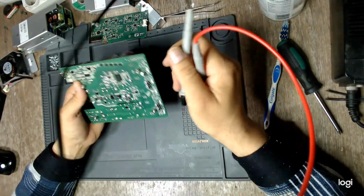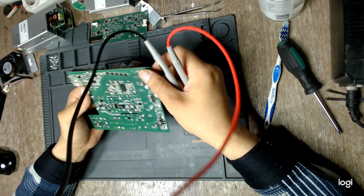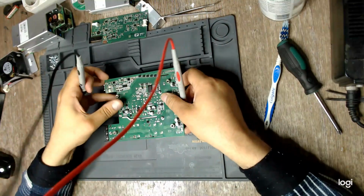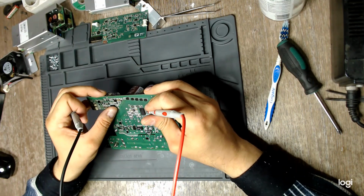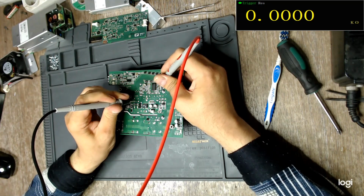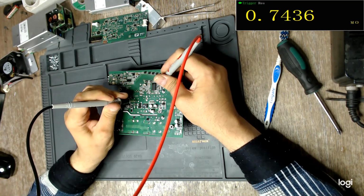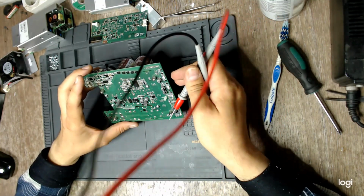I knew those diodes couldn't fail, but still, you know me and my redundancy. And speaking of redundancy, you know what the fault was with the other board, so why not? This is pin number 4. Do I have 750Ks here? Just to be sure, right? Come on, you can do it. Yeah, we do. So, nothing else seems blown.